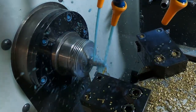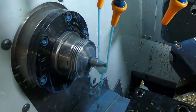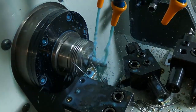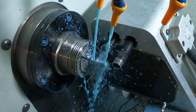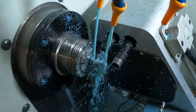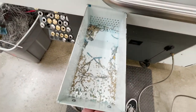Then the threading tool will single point turn a 7/32nds 40 pitch thread. The parting tool will groove a relief behind the part to make the live tool's job a little easier to cut the flats with a roughing and finishing pass. The quarter inch end mill was just big enough to do the job. A little deburring and part off. It took two or three tries before a good pin came off - this is the second good one off the lathe and I made one extra.